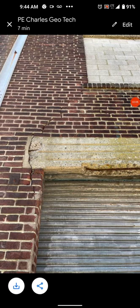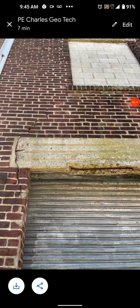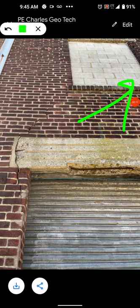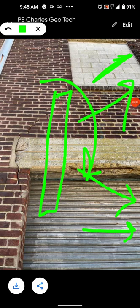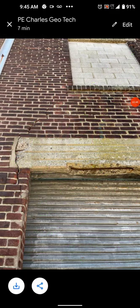This is all I have. I did write the person back and say, 'Hey, is the wall over here displaced — meaning is it starting to fall over?' All bets are off if that wall over to the right is displaced and starting to rotate. Or is it a continuous wall system with no issues? Is it bowing in? Let's look at the top view — is it bowing in to give us that action of pulling it in there?